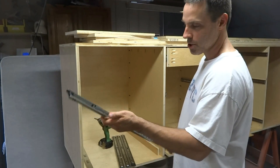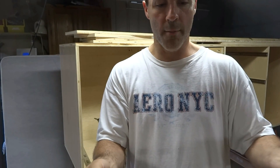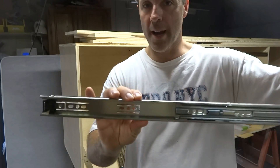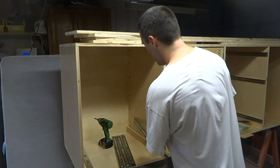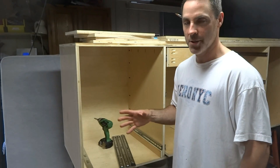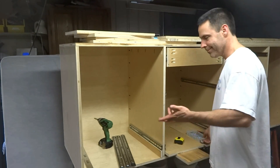I just want to show you — we're not even going to take this piece out like we did in the kitchen cabinets. There are basically slotted holes, and those are the ones we're aiming for. If you pull the inner mechanisms on the bearings out, you can see there's a lot of room for each of those. You always want to put the first few screws in the center of the slotted hole so you can adjust them left and right as needed, then come back and put screws into the round shaped holes once they're fully aligned. In the kitchen video, since the drawers were solid maple, I drilled a pilot hole for each screw, but because this is plywood, I'm not going to drill a pilot hole — you really don't need to.